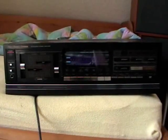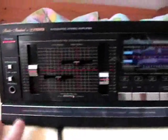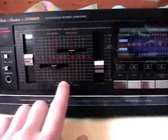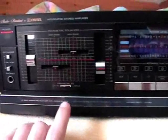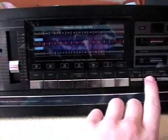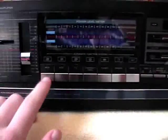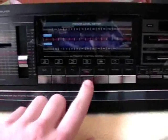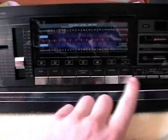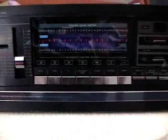I'm not sure if we've already done that, but let's take a look at the features. We have a power switch, speaker selector, headphones, a parametric equalizer which you can also turn off if you're using an equalizer, the nice VU meter which can either show 2 watts or 200 watts, the input selector. This machine has so many inputs: aux, VCR, television, compact disc, tuner, phono, tape 1, tape 2 — and tape 2 is actually for connecting the amplifier to an equalizer.